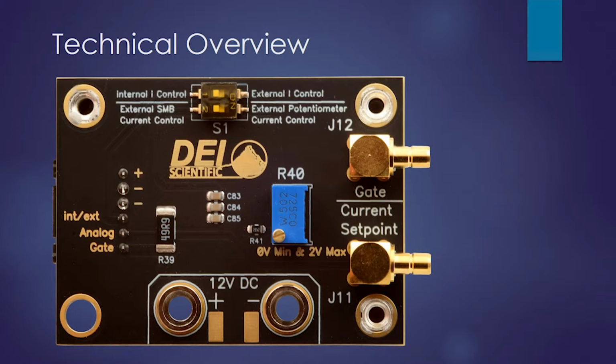The bottom shows a 12 volt input. Those are banana jacks, so you can use common banana jacks to give 12 volts to the system. On the right hand side we have two SMB connectors, one for the gate input and one for the current set point. The current set point is an analog voltage that you can put in to adjust the output current.